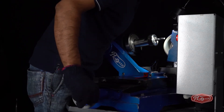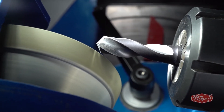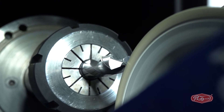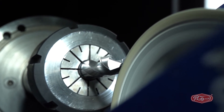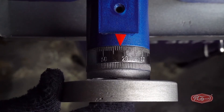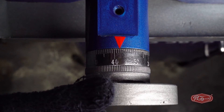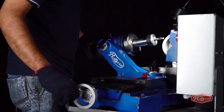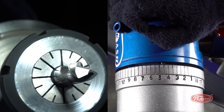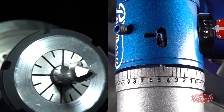Then, by moving the X-axis and the Y-axis, we will bring the drill bit closer to the diamond wheel. Now, after giving the depth of cut with the Y-axis, we will use the X-axis to sharpen the web edge. We will note the number on the X-axis, which is 40 in the video, and set the spindle dial wheel pin from number 4.5 to the opposite number 4.5.